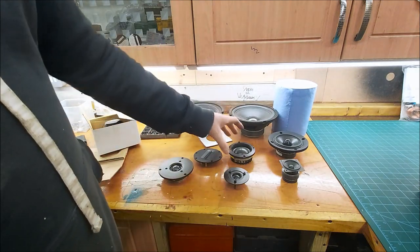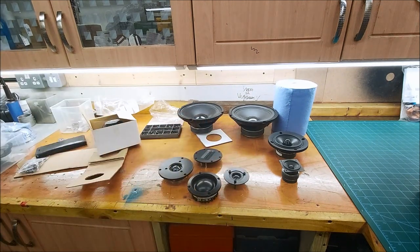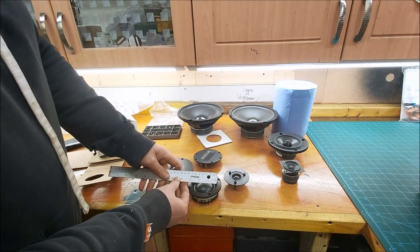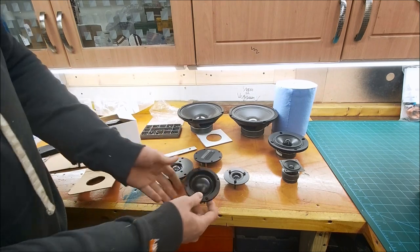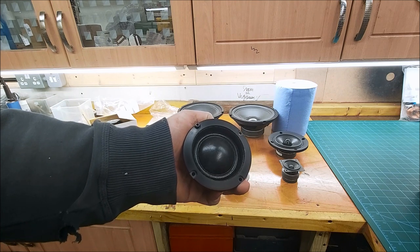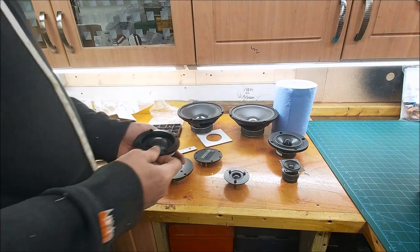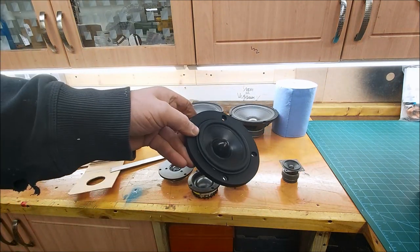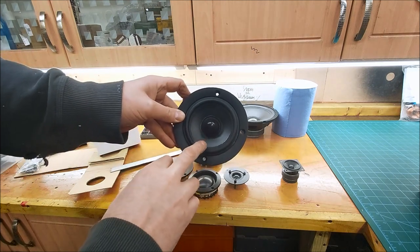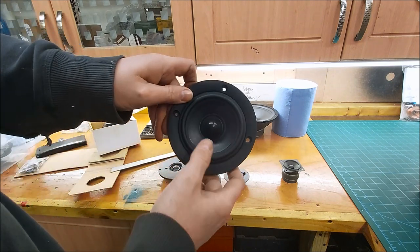What I'm thinking is I have two of these dome mid ranges - I think they're two inch, maybe more like three. These have quite a low FS and I think we can run these down to 750 hertz. So if we can cross these to that woofer at say 800, that would be really good. I do have these mid-bass drivers I could use, but they're four inch - a bit big really to use with an eight inch. I'd rather be using those with a ten, a couple of tens or something.